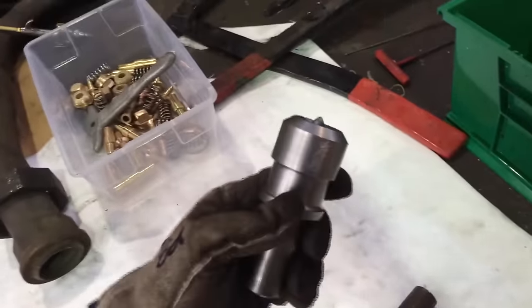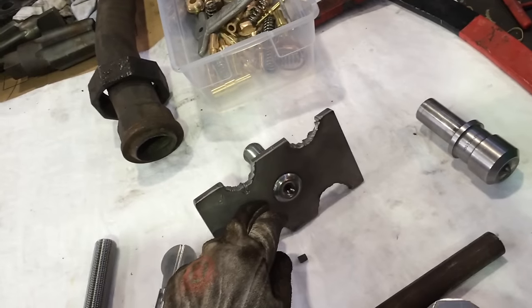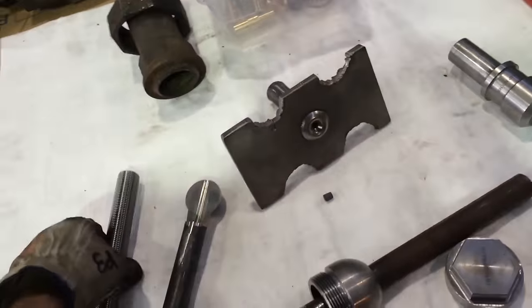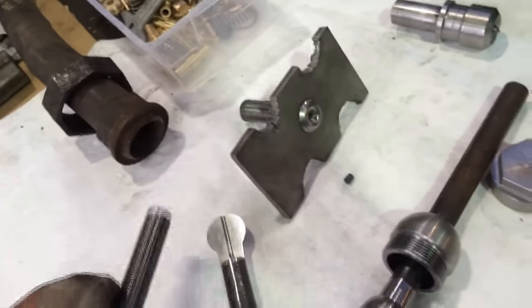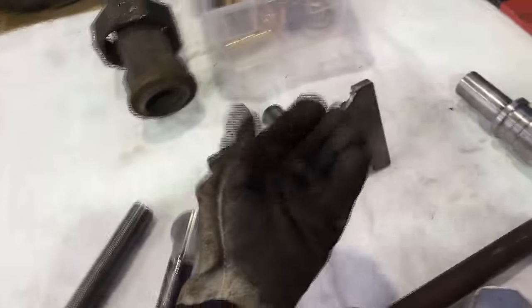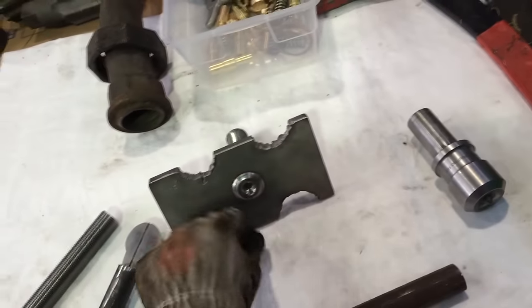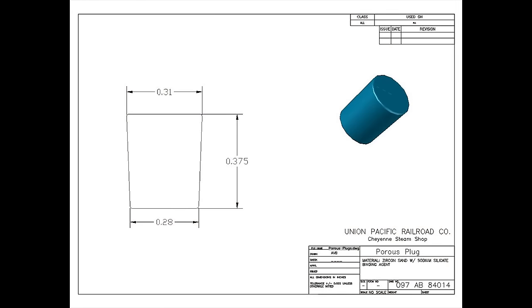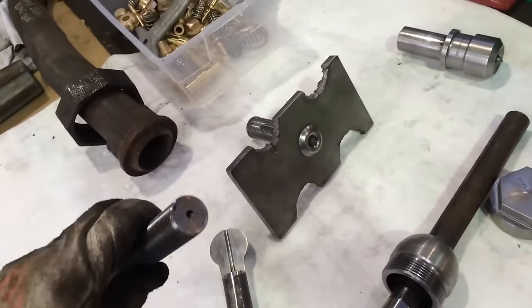We have made these tools — had them custom-made to suit the Union Pacific drawings. The forming process expands the threads of the staybolt into the sheet, helping create a very steam-tight joint, as can be seen here. Once this is done, it's necessary that the tell-tale hole be re-established. The tell-tale hole provides an indication of breakage. As that tell-tale hole is cleaned with a special reaming tool, we are in the process of actually remaking the porous plug, which is a cement plug that is then installed very carefully inside the tell-tale hole location. That prevents byproducts of combustion, sand, and other debris from fouling and contaminating that hole location and rendering that test feature of the staybolt inadequate.